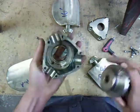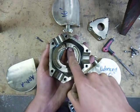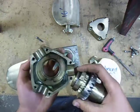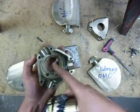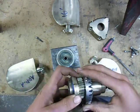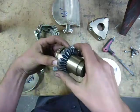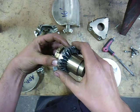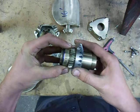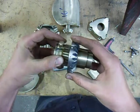Inside the body, you'll be able to see that there's an R and an L stamped on this stop. For a right-hand propeller, you need to take this R on the hub and make sure it lines up with the R in the body. You need to set your pitch by setting the position of the pinion on the hub. So if you are, say, a plus six, you count six splines in a clockwise direction for a right-hand propeller. Minus six is six splines in the anti-clockwise direction.